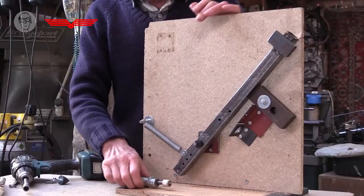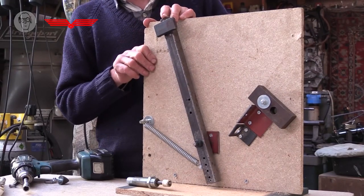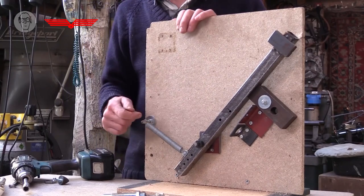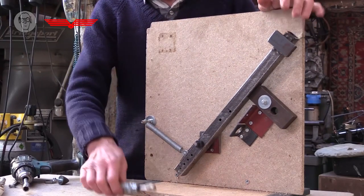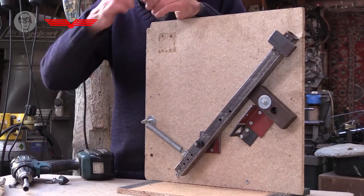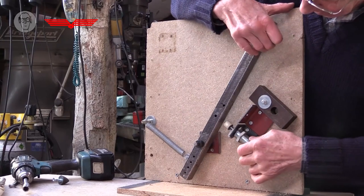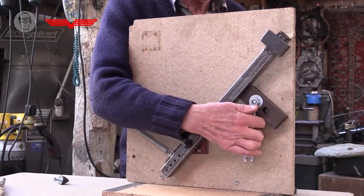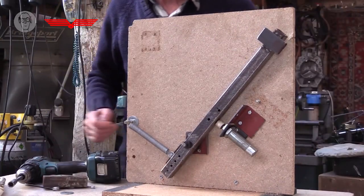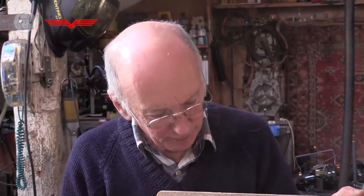But they are good. So on this model here, I've just connected this lever arm with a spring, and initially it's just going to land on a steel stop. You wouldn't want to have your finger in there, but it's a big shock load for the mechanism. If I replace the steel stop now with a shock absorber, that'll be a big difference. So now, repeat the experiment. It's just beautiful the way it brings it up to a controlled stop.